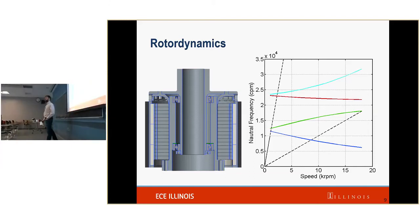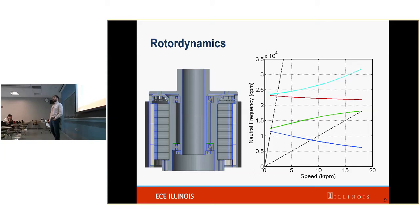But with the cantilever structure, if you are in a horizontal position, will that change the rotor dynamics? I didn't get the answer completely. So if I test it in a horizontal plane, yes. These two are the bearings, and this is the spring, which is setting the preload. In the two different positions, the preload on the bearings, in both the radial direction and the axial direction, will change. With those different preloads, that will affect where these are. But that's one of the reasons why we put the spring in there, to try and decrease how much that will change.